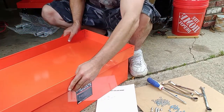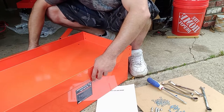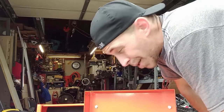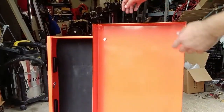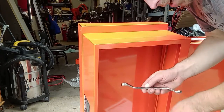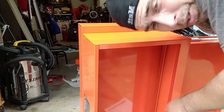Put the top shelf on the drawer box, line it up with the holes, and then you can get your hand in through the drawer or take the drawer out — whichever you prefer. Getting those four 13-millimeter nuts and bolts with washers on each side is a little bit of a challenge. The easier way is to tip it on its side, pull the drawer out, and get access from the back. You'll definitely need two 13-millimeter wrenches or a wrench and a ratchet. I used a flex-head wrench to get up in there and snug those things all the way down nice and tight.